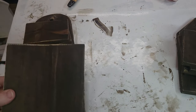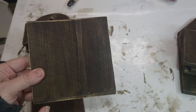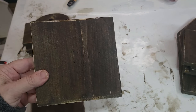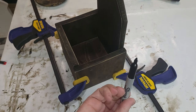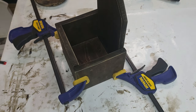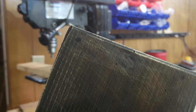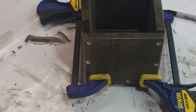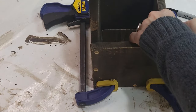The next step is to do a dry fit, which simply means I'm going to put everything together with clamps, and then I'll make some markings where I need to pre-drill holes for the screws. I'll just use my Sharpie to make the dots for where I need to pre-drill. And the marks that I made — that will be the back — which will also help me in assembling these. Here I've got everything dry fitted, I've pre-drilled my holes, and I can just put my screws in.